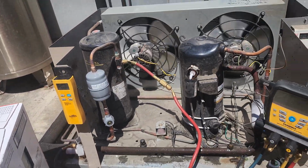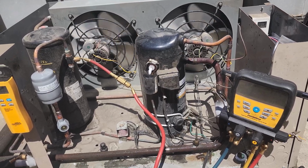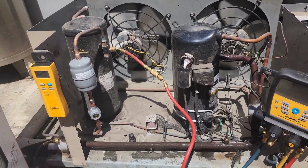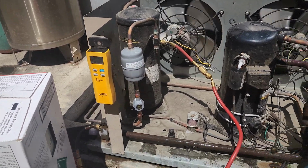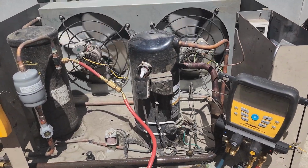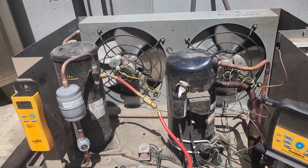So in case someone has to do a leak repair in the future and it doesn't completely run out of gas and they don't know how much gas had been lost, they could literally just fill it up to that mark. So at this point, we're gonna let the system run a little bit longer, go check on the vitals over at the intelligent display inside the box.